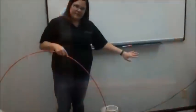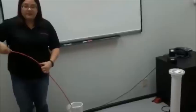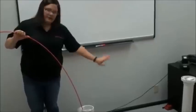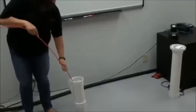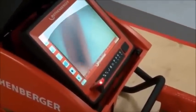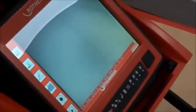What we have here is a simulated drain line — the end is capped off with plexiglass to simulate an obstruction. I'm going to feed the ROCAM 3. It's got a 3/8 inch diameter cable — very flexible yet also sturdy. We have a 90 degree turn here and we're going to make that turn with no problem. As I feed the camera head, it just made the turn. I'll push until I hit my obstruction. Looking at the camera, I found a pen, and feeding further until I reach the end — you can see Brian Wilson's business card there.